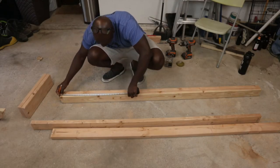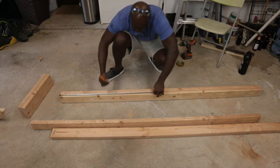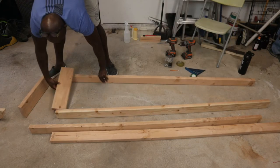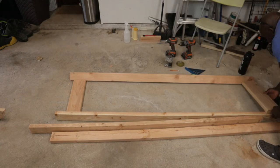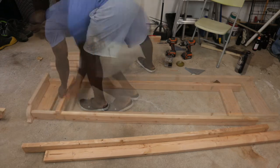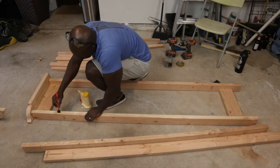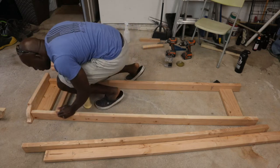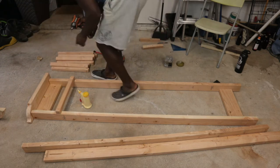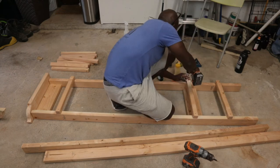We move to my assembly table where I'm marking off both legs in preparation for the trellises. To make things even easier, I cut a pair of spacer blocks to be sure I was on the same width on both ends of my trellis. I used glue and exterior screws on each trellis to make sure everything was going to be secure and outdoor ready. After the first trellises were done, I fell into a rhythm, and before you knew it both legs were complete.